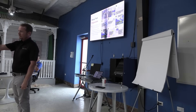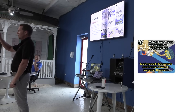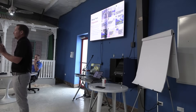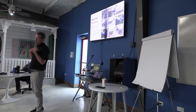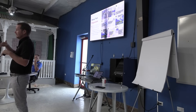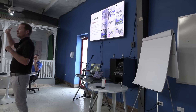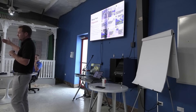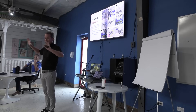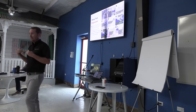All they've got to do is get to 200, then do an isolation test with one ball valve — let it sit and see if it goes up any significant amount. Our standard: pull to 200, and if it doesn't go above 500 in 10 minutes, you're good. For a residential system, if you've hit that number, you don't have any significant leaks.